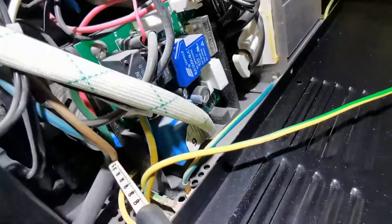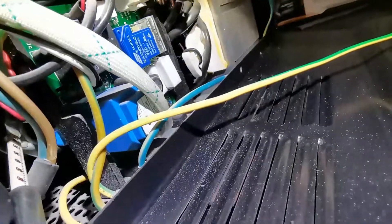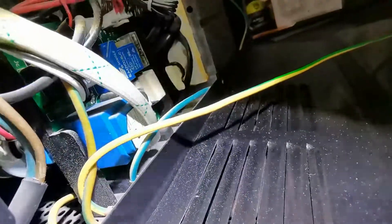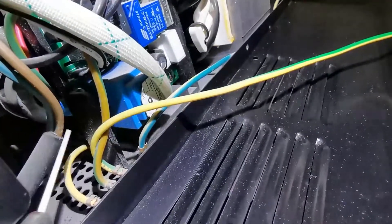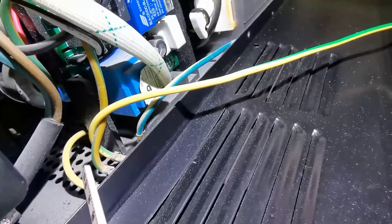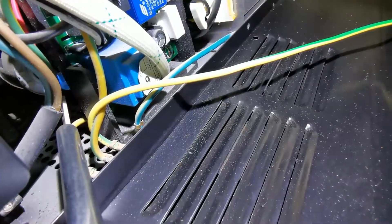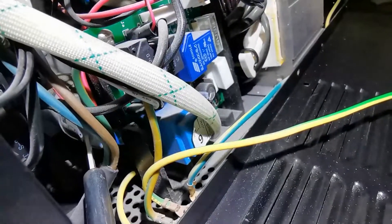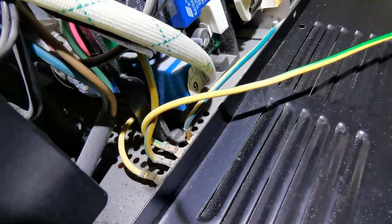You'll see the motor has two wires going to it — one here and one down here, which is the earth. You can tell by the colour: the red one is positive because it's a DC motor and the other side is negative. What you're going to want to do is get two car batteries and some little probes, and with the machine turned off, put your earth on one terminal and the positive on the other. If you provide 24 volts to that motor and it doesn't spin, that's stuffed.